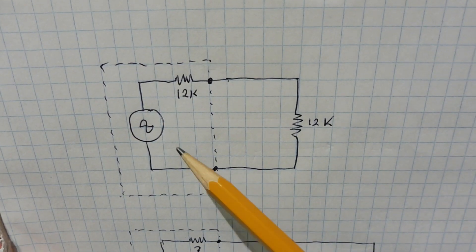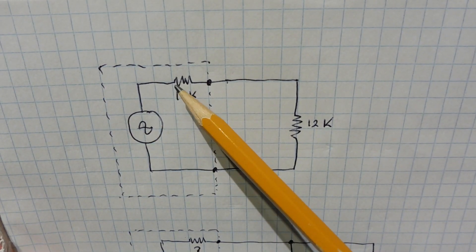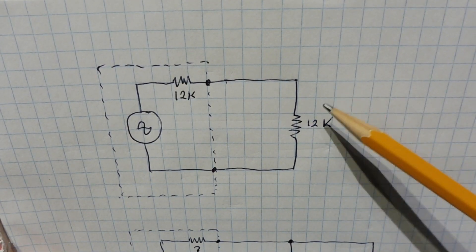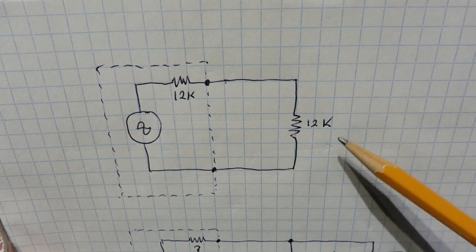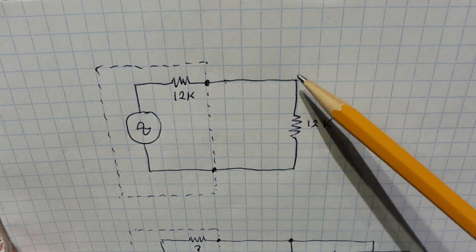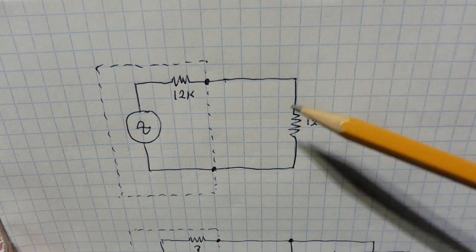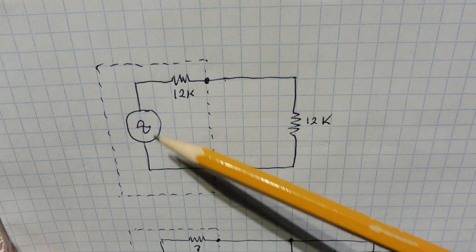Here's my device that puts out a small AC signal, and the output impedance is 12k ohms. So if we put a load of 12k ohms across our device — which would be the input impedance of an amplifier — we're going to lose half our signal by Ohm's law. We have 12k ohms of output impedance and a 12k load, so we get a voltage divider and lose half the signal. Generally we want a load of 10 times our output impedance, so about 120k ohms, so we don't load down our signal.